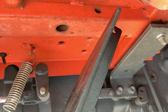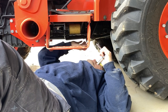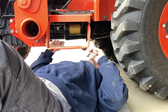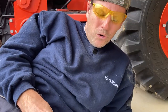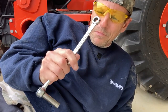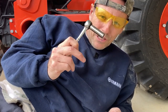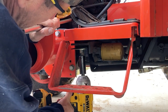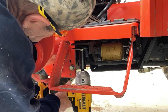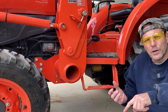Here's the side view — here's the guard with the small washer in between, the big washer, the lock washer, and the nut. Leave the front bolt loose so you can maneuver the backside easier to get that bolt through the hole. Use ratchet wrenches if you have them — they're very versatile. The last step is to tighten the floorboard bolt, and on this side it's exposed so you can get your impact on it. The driver's side was a lot easier. I'd allow maybe 30 minutes for the other side and maybe 15 minutes for this side.